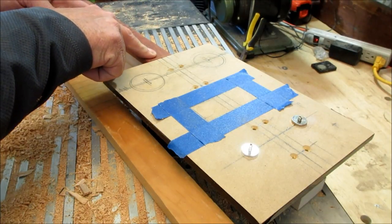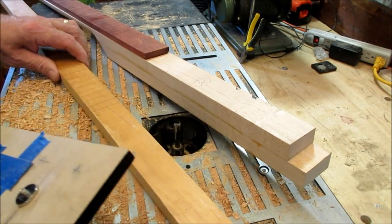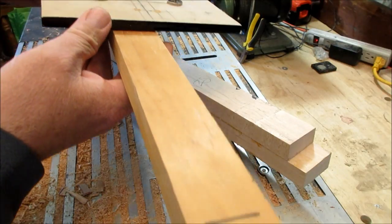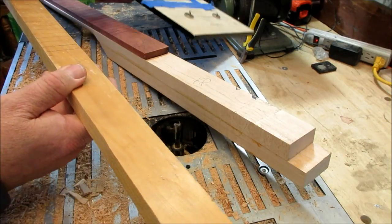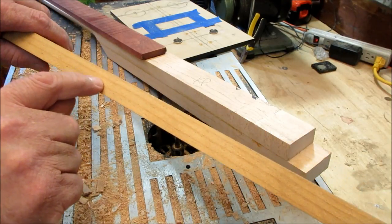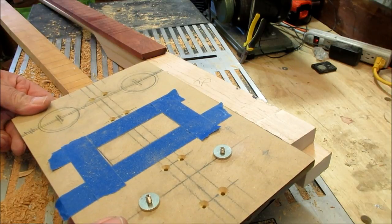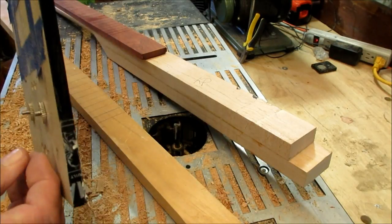Of course, the frets are going to be a little bit taller, but this is not a desirable situation. It's even worse on one that you're just using the board and setting this up on here, because if you look, this is so much higher there. There we go, we're in the camera. And in order to get the strings at the right height, you would almost have to route out down double the box thickness. But here, you're going to have to route out at least pretty much the same distance down into the neck as the box thickness here.